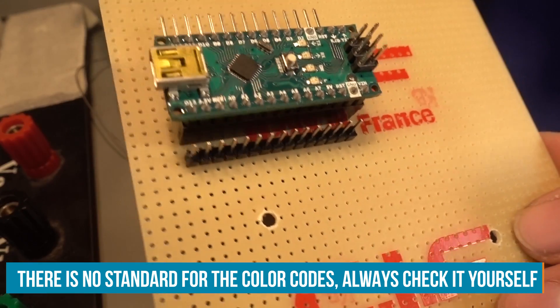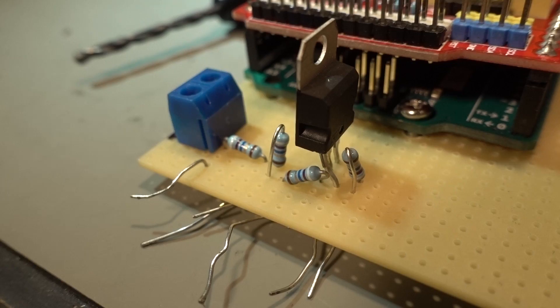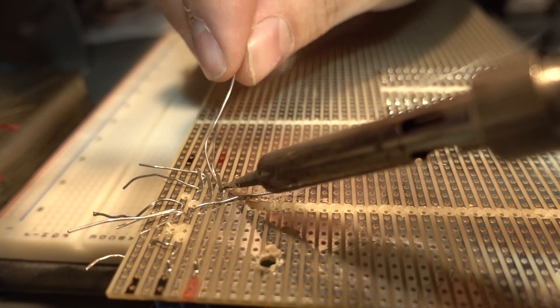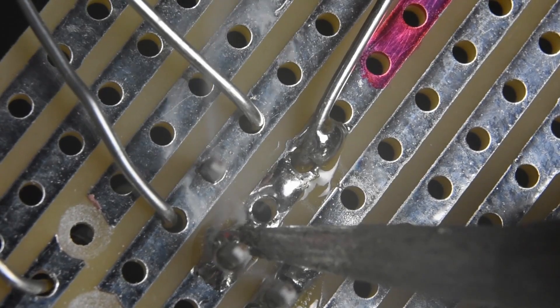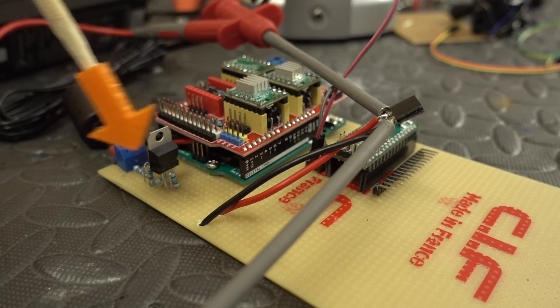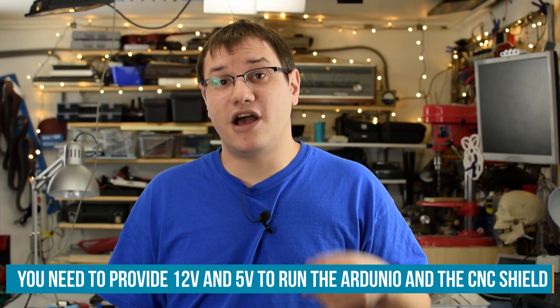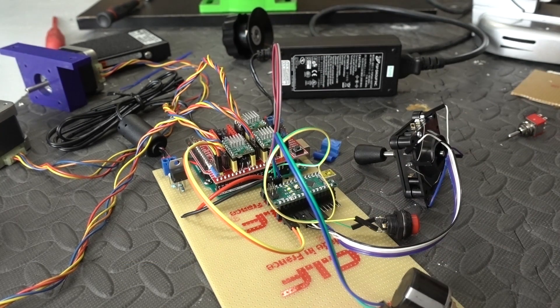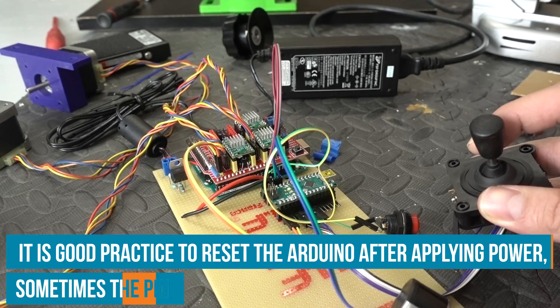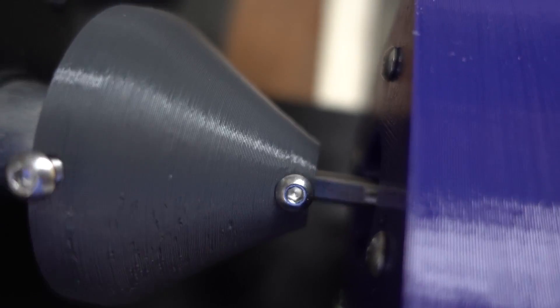I use some stripboards to create a plug-in for the Arduino Nano with handy attachments for all the button inputs, as well as a power supply made with an LM317T voltage regulator that you can set to your specific desired voltage. I use it to knock down 12 volts to 5 volts fed into the Arduino Nano and Arduino Uno, while additional 12 volts go to the motor drivers and a cooling fan. I tested every component separately to confirm the wiring was correct, then plugged it all together for a test run. This is it running with standard motor drivers — pretty loud. And this is it running with the TMC2130s — nearly silent.